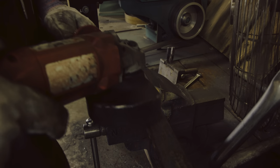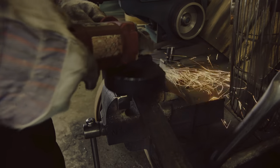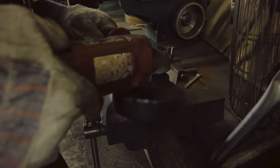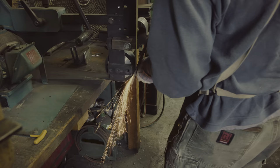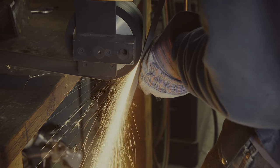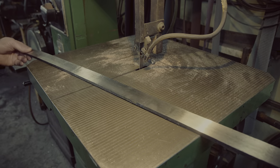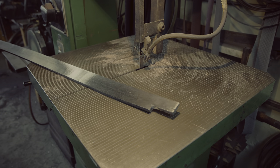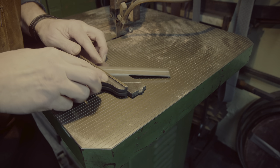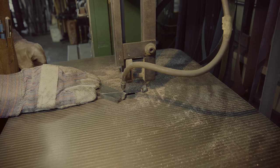At the moment, this looks quite ugly. Before I do any further forging, I will grind down the surface until it is completely flat and all gaps have disappeared. With a fresh belt on the belt sander, this happens quite quickly. Since this is a single-edge blade, I need to establish a tip. My preferred method for that is to cut a reverse tip that needs to be forged back. The reason for doing that is to ensure that the pattern in the blade smoothly follows the blade edge — I find patterns just running off the blade edge to be somewhat ugly.